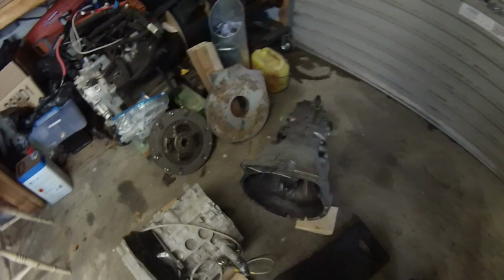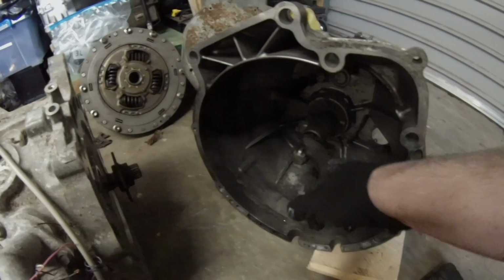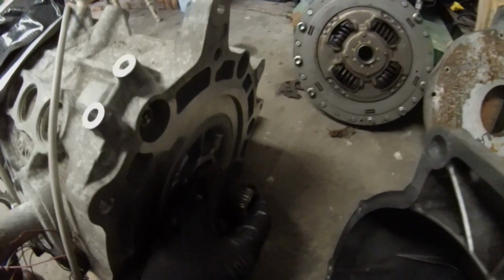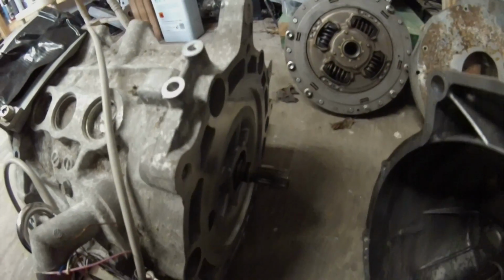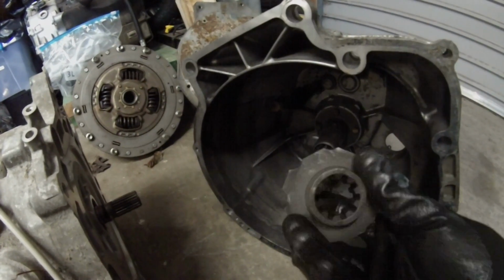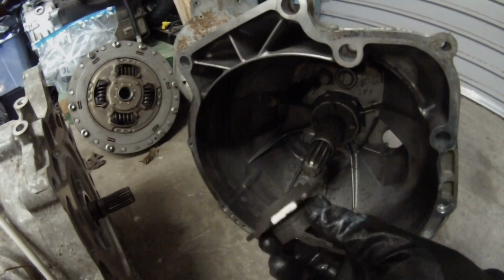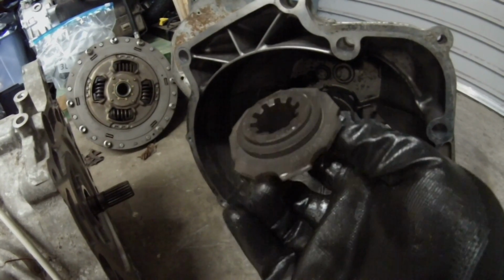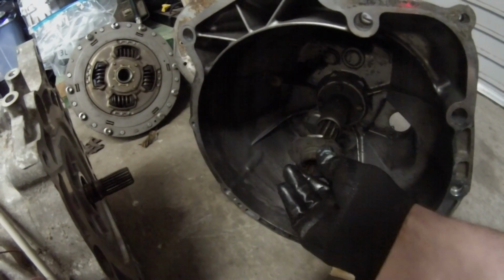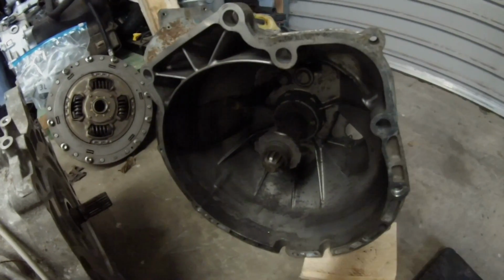Now, both of the shafts in this case, the BMW gearbox input shaft and our Nissan Leaf motor, have got splines. Fortunately, in the case of the BMW gearbox, we've got this guy. This is the center of the clutch friction disc that I just basically chopped out. I spared you guys the agony of having to watch me doing that, but that's just a basic clutch disc. And that just slides on here and mates up to the splines of the input shaft.